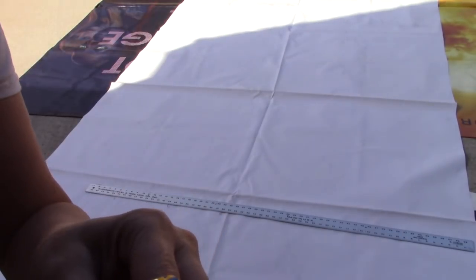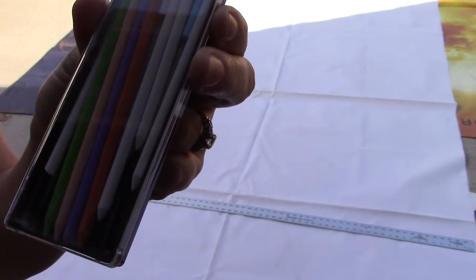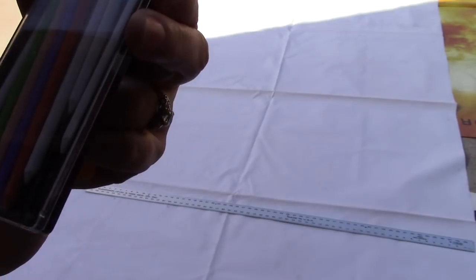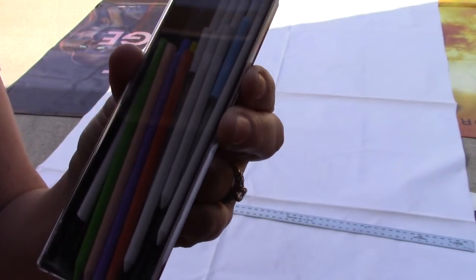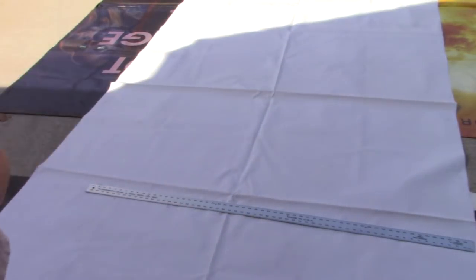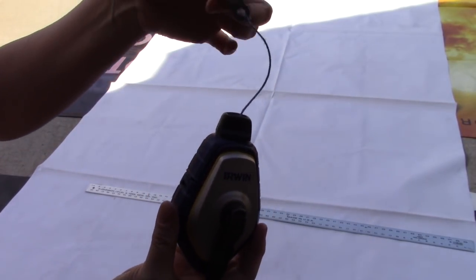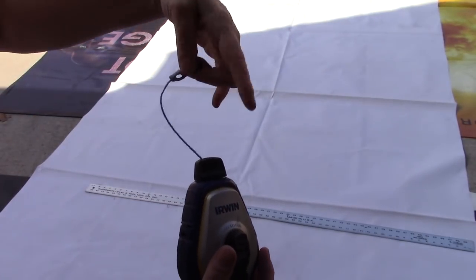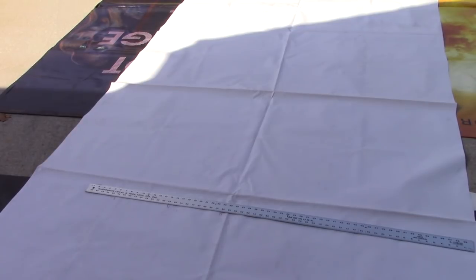These chalk pencils come with a container of different chalks so you can replace them — sometimes I need white chalk, sometimes I need colored. I like the pencil form and this is working really well. I think it's by Dritz — I got it on Amazon and it even comes with a little sharpener. If Jason is out here working with me on weekends, we use one of these chalk line things, but it takes two people. I mark where we need a line, stretch it across, snap it, and it leaves chalk down there — that goes a lot faster. When it's just me, I do the marking manually.